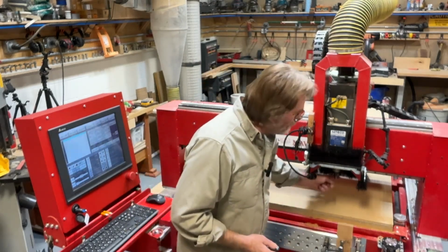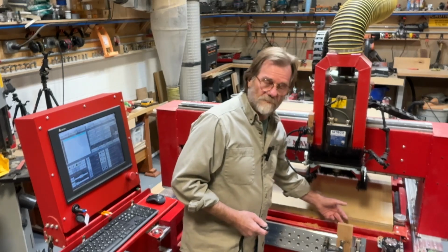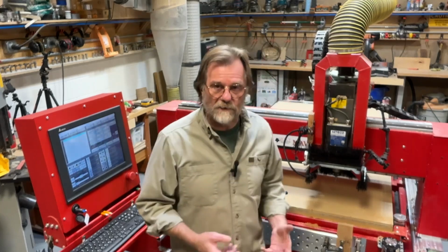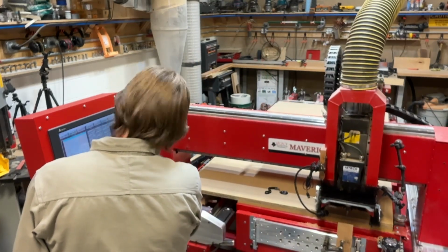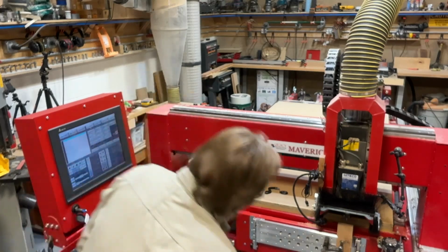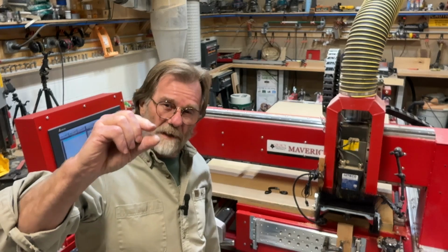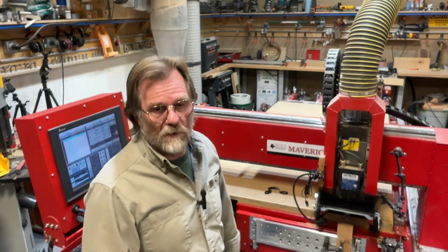All right. My goal here is to set this tool about 1/4 of an inch behind this surface and about in the middle of it. So I'm just going to jog till I get there, and then we're going to turn the spindle on, and I'll show you how to use that edge finder. Let's go forward. Now the x-axis is much faster, so it jumps a little bit faster. I'm going to get a little closer. I'm going to go down. And right now, about that much of the tip, about 1/4 of an inch, is below the top edge of the part. So I'm ready to go.